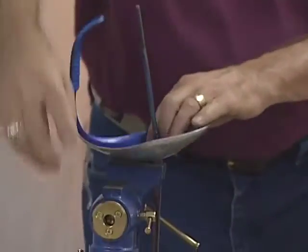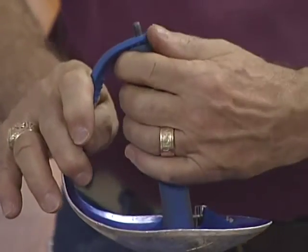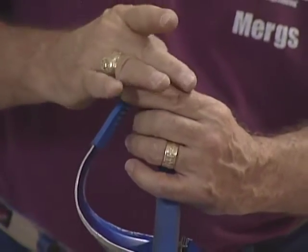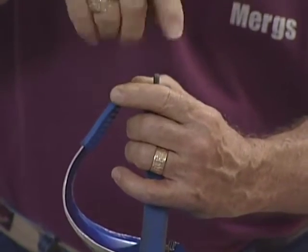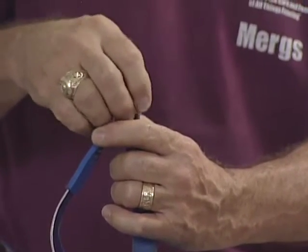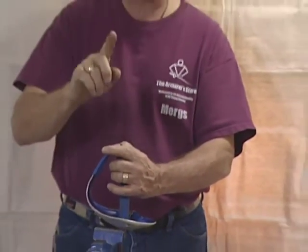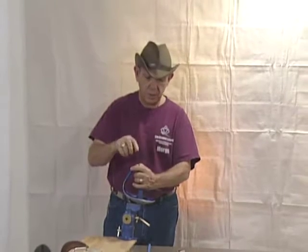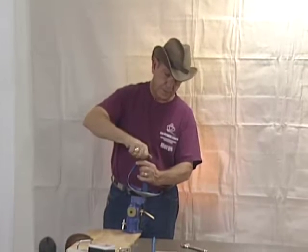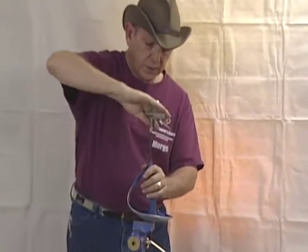Slide the socket over, take your grip, and slide it on. Put the end of the guard over the tang. You can take a flat washer and place it over the tip — this one is serrated, which will help maintain the grip between the pommel nut and the lock washer. Put one lock washer on — not two, not three, one — because the lock washer is designed to provide tension back to the pommel nut and won't allow it to back off. Put on your pommel nut and tighten it down. Most pommel nuts use an inside hex, six-millimeter hex wrench to tighten down.